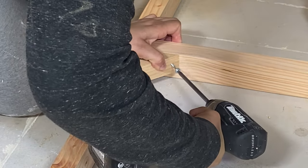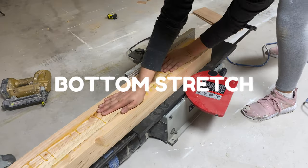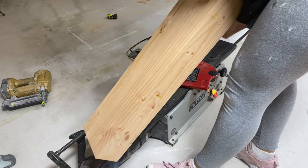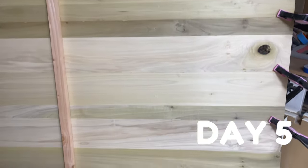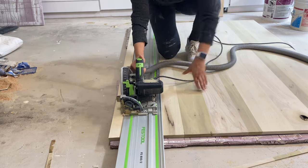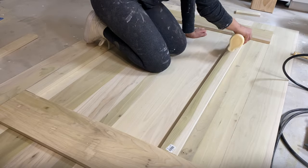This involved a lot of measuring and making sure the height was right. In the end I built my base at a great height — I'll leave the measurements in the description below if you're interested. Now I'm cleaning up what will be the bottom stretcher, a last-minute idea to add more strength to the base. I'm jumping a few steps already covered in a previous video, like the table top, but leave any questions in the comments and I'll be happy to answer. I also decided to add a support under the top to help with strength and hopefully avoid bow or cupping.